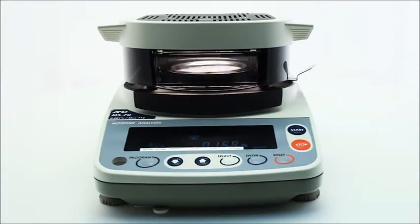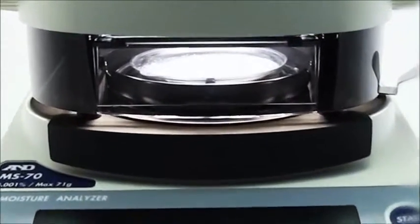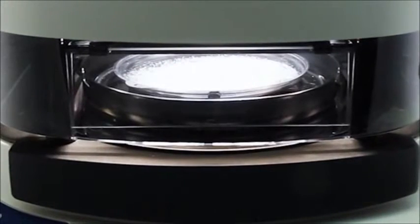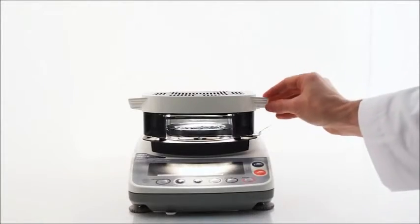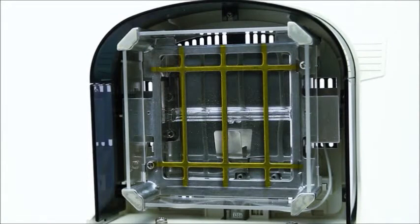With the progress window, first offered by A&D, you can observe the drying process and be sure that the sample is not being burnt or scorched. Together with a powerful 400-watt lamp, the patented secondary radiation assist provides controlled, uniform heating to quickly dry samples.